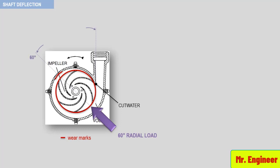This would be induced or caused by operation if the plant operators strangle valves to control production flow. Also, any other discharge flow restriction like clogged filter, pipe obstruction, or uncalibrated automatic valve will produce the same evidence. In this case, talk with the plant engineer about this situation and show him the evidence on the pump.